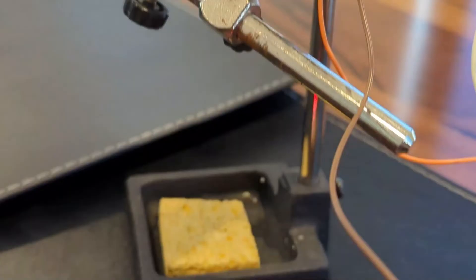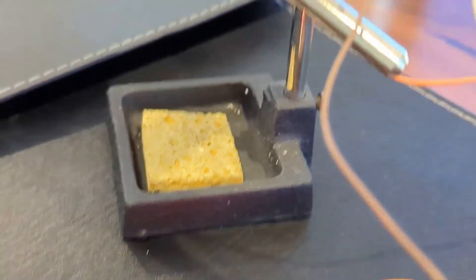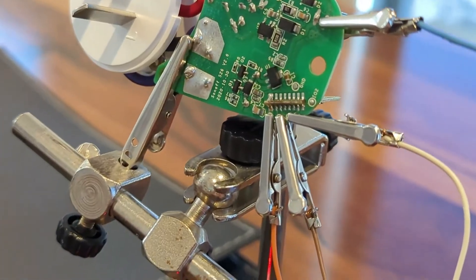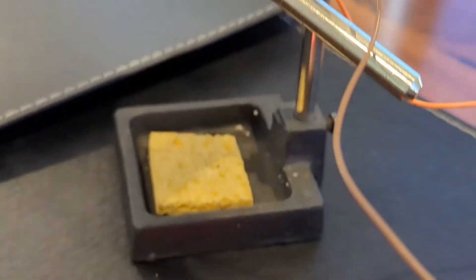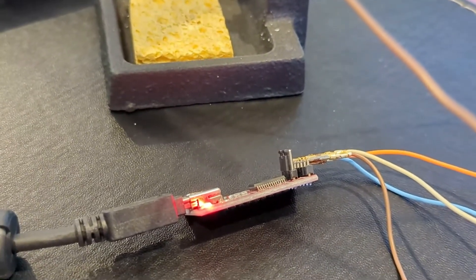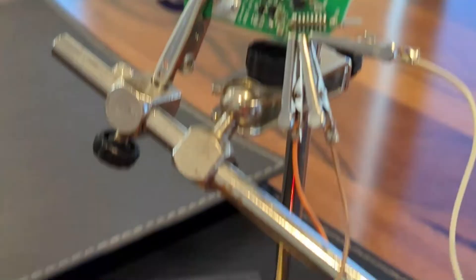For those not used to it, you'll find on your flasher it has RX and TX and you want to swap them over. The RX on the smart plug connects to the TX on the flasher and vice versa — TX on the flasher goes to RX on the plug, and RX on the flasher goes to TX on the plug.